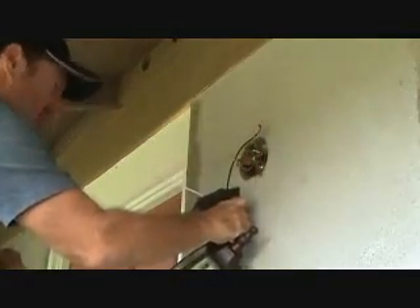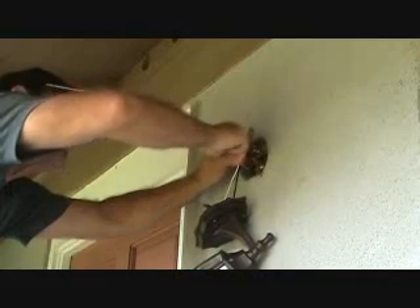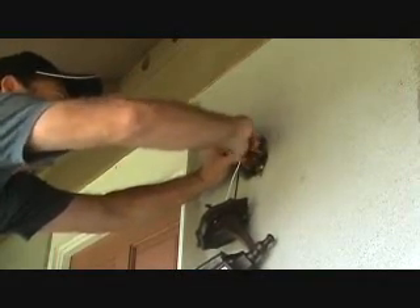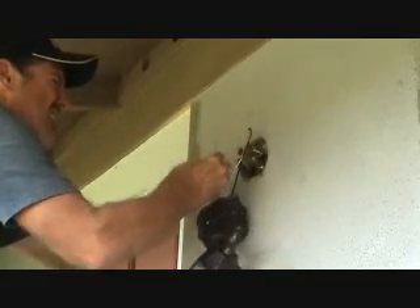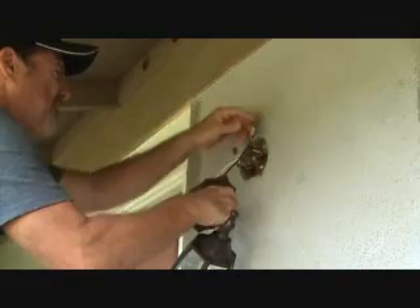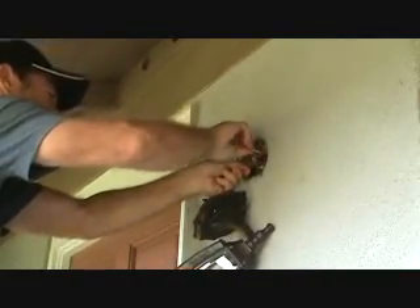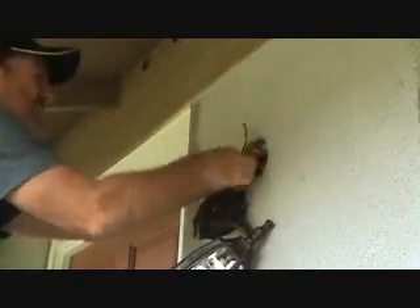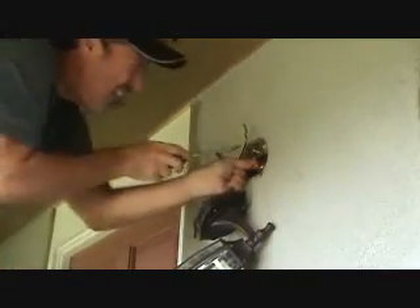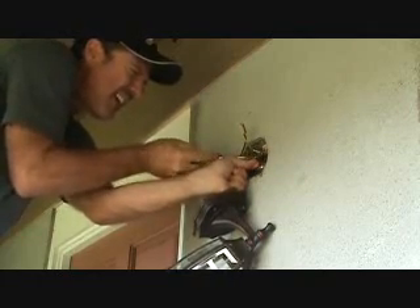I pulled on it and that feels fine now. I can do the white wire — I'll hold that there. The key is you don't want to have too big a wire nut here, and generally the ones that come with the light fixture will work okay. Now I can move those wires out of the way. I've got to wrap this ground wire around that screw, wrapping it the same direction as how I'm tightening the screw. I put a couple of twists on it like that, and now I can tighten that up.